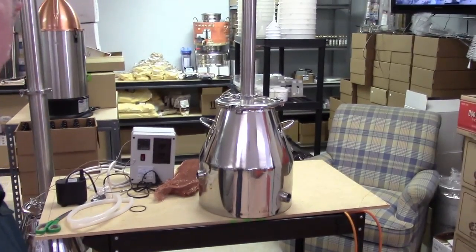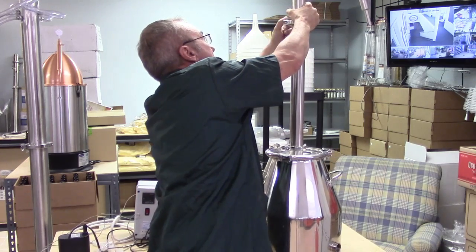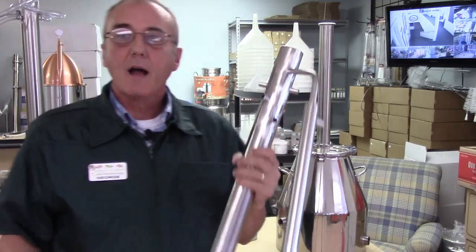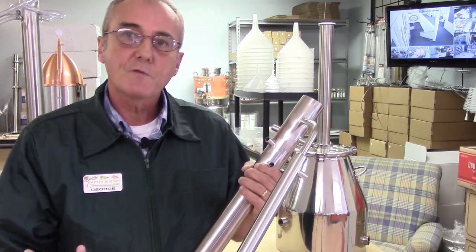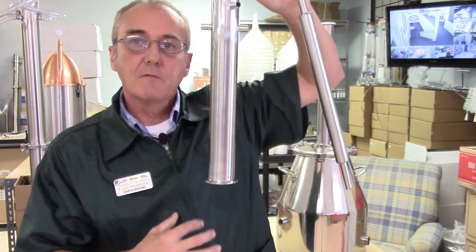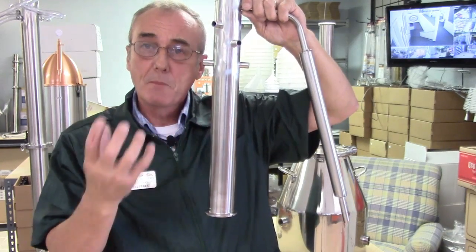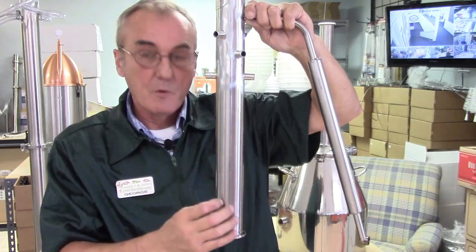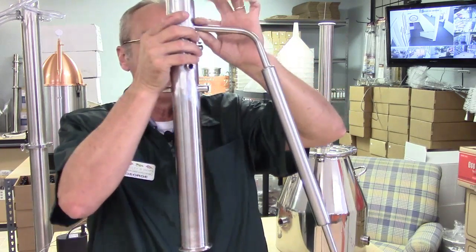We've had a little bit of confusion about copper mesh inside the column. I use it as a habit — it's a really good medium. I've also used marbles; marbles are amazing because they're easy to clean and have a lot of surface area. What we want is for vapors to rise and pre-condense, start to condense and drop, and as they drop the most volatile substance — ethyl alcohol at the lower vaporization point — we want it to rise again. That's what reflux is: a continuous process.